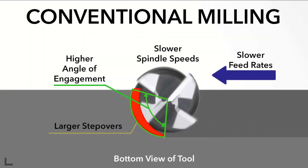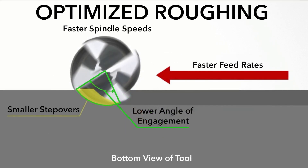If you have a large arc of contact, you get lots of heat. Whereas if you have a small arc of contact, you have less heat, more controlled tool life, less wear and tear on the machine, and throughout your overall process you're going to get more consistent results.